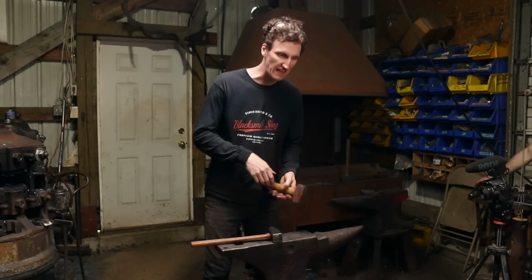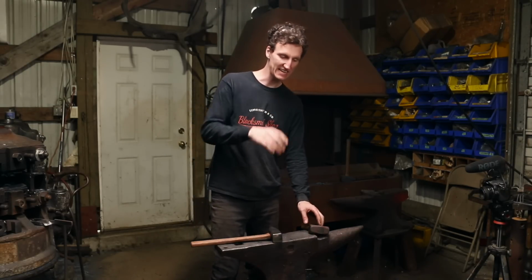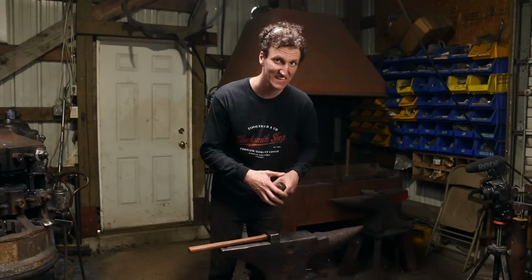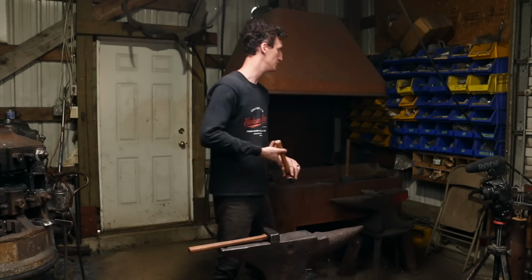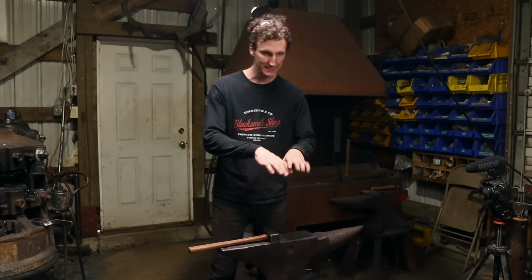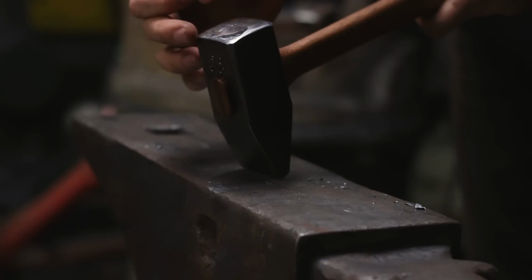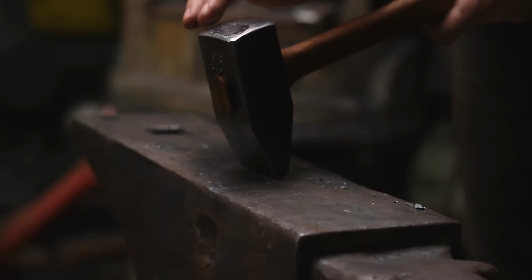If a hammer is dead flat, you have no control of it because you can never hit exactly where you want to. I know it sounds contrary to what you would think. So when you buy a hammer from a store, they're usually pretty flat and they have this super crispy line, this huge chamfer on the edge. The problem with that is you have to dress it, right? So you round it in, and when you relieve the edges, you have such a radiused edge due to that big chamfer that you actually lose the ability to tune in tight stuff on the corner of the hammer.